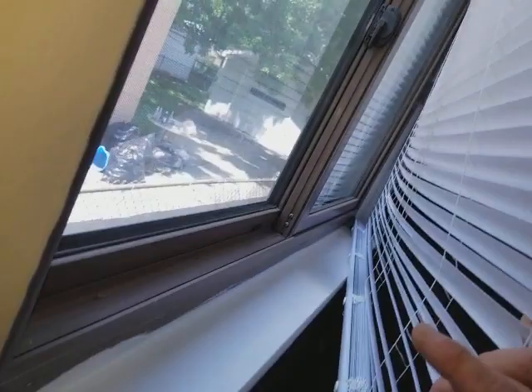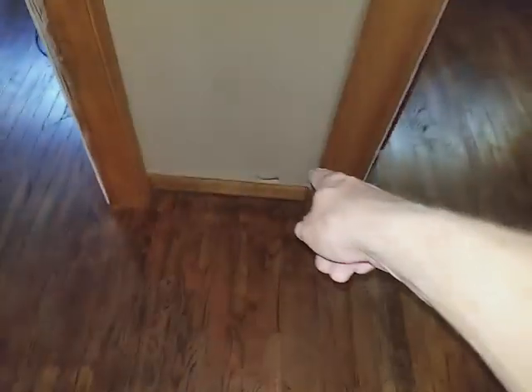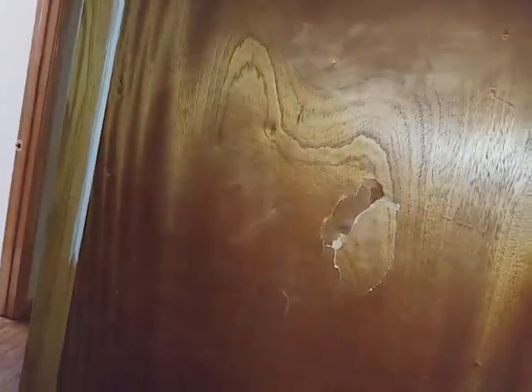So repaint this room. Light bulbs everywhere — where they just decided not to put light bulbs in, do all of them. Clean it up. Door on this side is fine. Hallway needs a new bulb. There's a hole down there that was tenant damage — his foot — patch it. Another door has a hole; she said her son just leaned into it, and I told her that's tenant damage. So you will need to replace this with a new Luan door — you can try to stain it to match the rest of them.